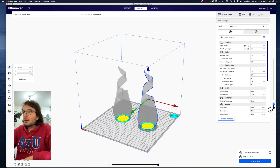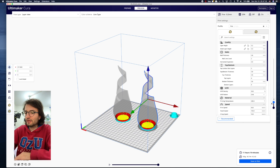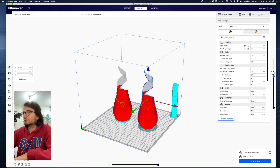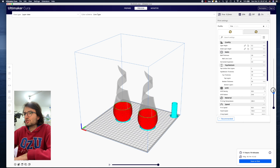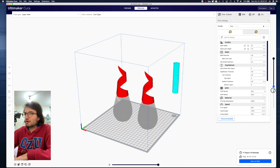We have many layers. Let's say I want to use extruder one up until layer 40 — note that down. Then I want a color change transition from layer 41 up to layer 750. After layer 750 — let's say the final layer is 939 — I want a full solid different color. I need to know between which layer ranges I want the color mixing to occur.